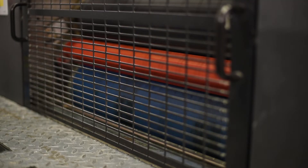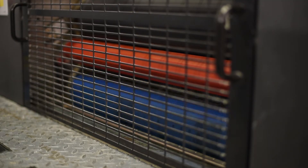On the second day, we will put the rollers in, and at the same time we will install the LED dryers, because we can do both things at the same time. So normally we do a complete press conversion in two to three days maximum.